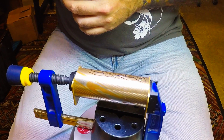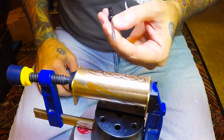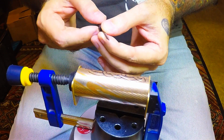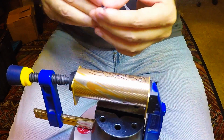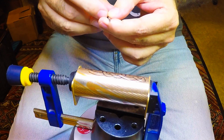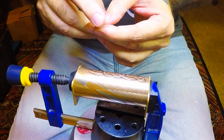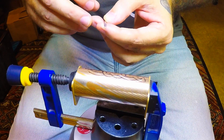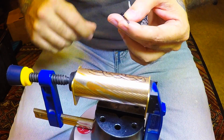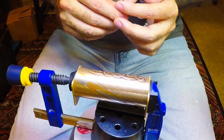All right, so let's get this situated. And what I'm going to do before I start is grab a quick sharpening on this. I need to make sure that my lines are straight. I want to ensure that my graver geometry is correct, face, heels, and then my facets that I cut so that I can actually see what I'm engraving. It makes it a little bit easier for me. So give me a moment. I'll be right back, and we're going to get started on this engraving.